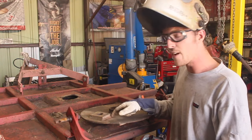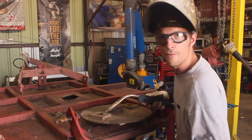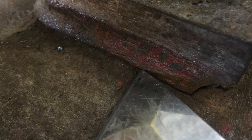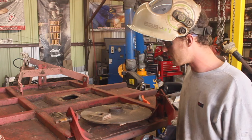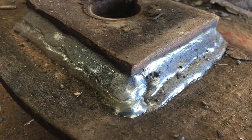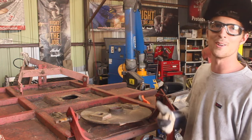Looking at this closely, you can see the crack appears to have originated in the crater of this weld, which is normally a weak spot, and then it just sort of goes to the bottom toe line. Whoever welded this, they probably didn't reinforce the crater enough. Most of you know when you're welding along and you stop, you want to stay there for a second, second and a half, maybe two seconds, to fill up that crater to prevent things like this. It looks like that's where the crack started. This weld was clearly done too cold, and the way you can tell — if we look at the bottom toe line — there's a sharp bridge right here where the weld meets the base material, so you can tell it wasn't melted in there, it wasn't fused in there all that well.